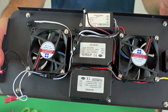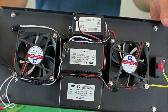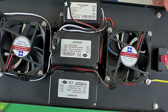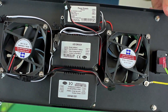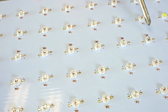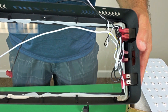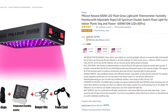Lastly, the build quality is very, very basic. This is the kind of LED grow light that gives real LED grow lights a bad name and causes confusion in the LED industry, especially for less experienced growers. This unit has single LED board construction, hand-soldered LED chips, and no heat sink — just a fan for cooling. This is something that you would have found 7 years ago if you were buying an LED grow light, which is why this light is so cheap. Again, a 0 rating.